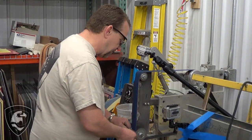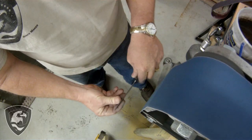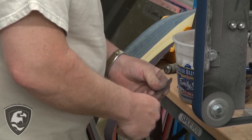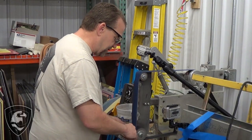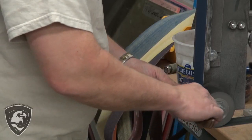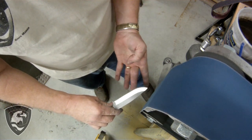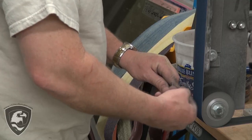After we get the basic convex formed, it all goes pretty quickly. I can see the start of a wire edge coming over on some spots. I'm checking the edge to make sure it's even all the way — I can see it's a little thicker right back in here, so I'm going to spend a little bit more time there. One of the things I see beginners do all the time is they grind, grind, grind and then check their work. Watch your work as you're grinding — it's okay to look every pass. You can't just do four or five passes and hope it comes out. Check your work on every pass.